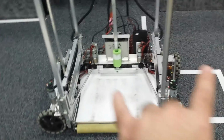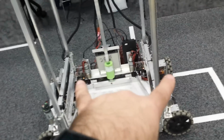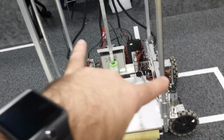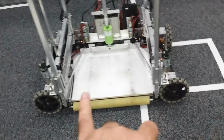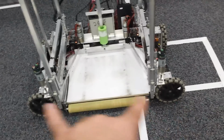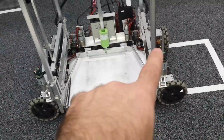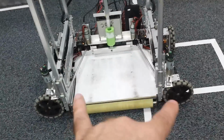If you try to move that way, the wheels will try to compensate going that way. And obviously, by using the opposite pair of wheels for the rotation, it doesn't affect the driver's control of moving it sideways. So the driver still has full control over the speed and distance of moving the robot, since the actual driven wheels by the driver are not the driven wheels by the compensation, and the compensation wheels will not interfere with the driver's control.